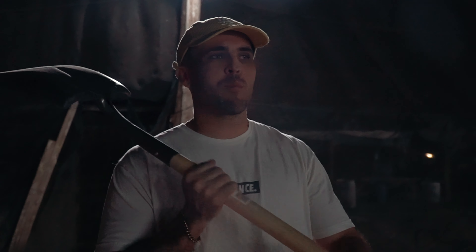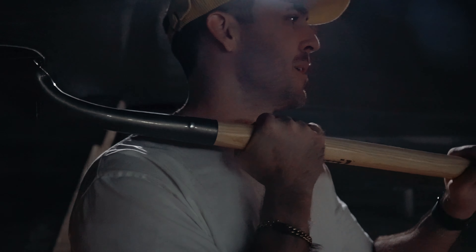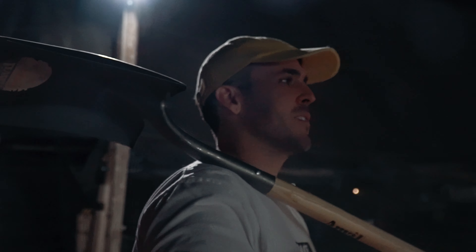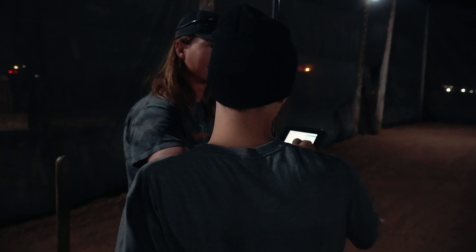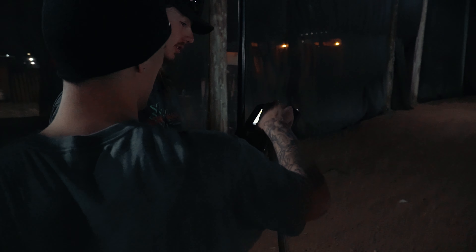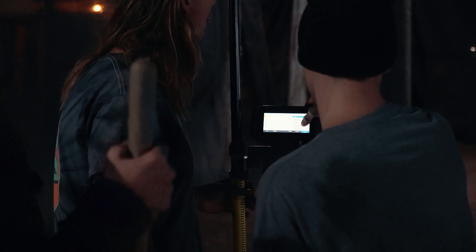Right now we're just leveling the field some more. We brought dirt from the edge of the Dorito side to the snake side over here. We're going to put some dirt from out there first, then quarter minus on top of that, just trying to fill in the spaces that are a little too low. The GPS is precise to the hundredths — you're looking at elevation numbers like 256, 254 — so it should be at one percent slope.